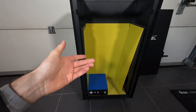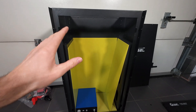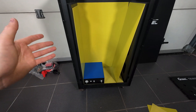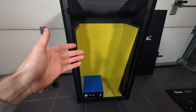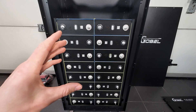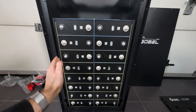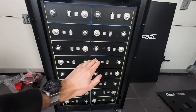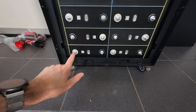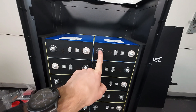Now I put the battery upright, added the epoxy sheets, and will start building up the battery this way. If I put it on the floor, assemble the battery and then try to lift it, I might not be able to. I just finished putting all the battery cells in the box with all the epoxy sheets — 1, 2, 3 cells with epoxy sheets between each one. Make sure when you place your first cell, you have the negative on the left, so you'll end up with the negative and the positive correctly positioned.